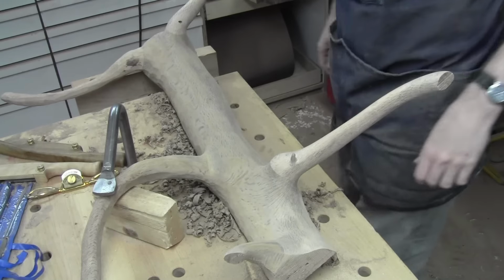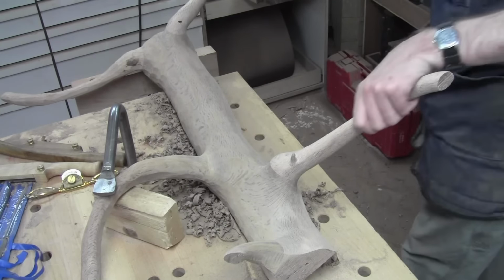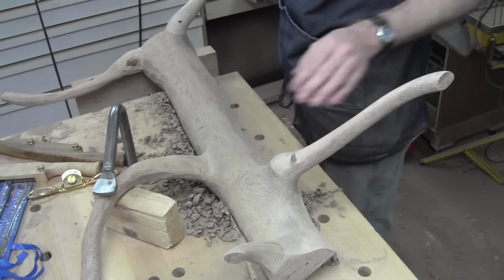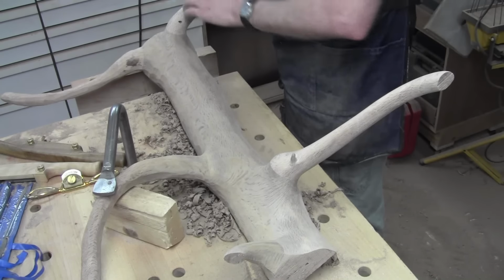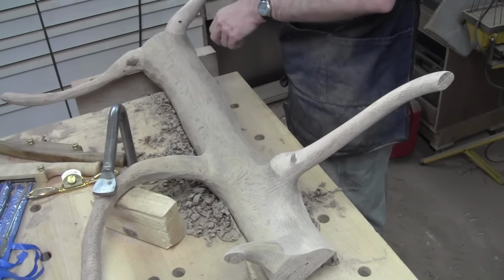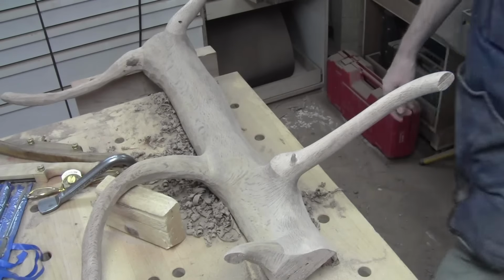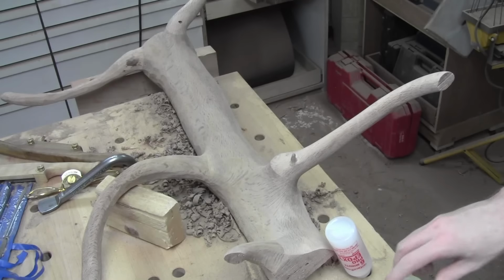Well, that's pretty much one half essentially fully shaped. It's really smooth. I've got a little bit of sanding to do in here, but not bad. And a little here where the radii get really tight, where it gets kind of snug to get the sander in. It's tough to get to. I've obviously sanded through to the plugs again, so to the pegs. So I'm going to have to mix up a little epoxy soon and fill them. I think we'll just do that next.